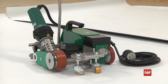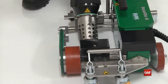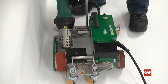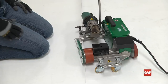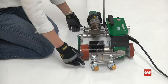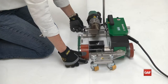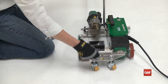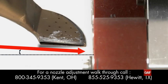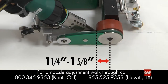It should take about 3 to 5 minutes for your Roof on Edge to rise to full temperature. The design of the Roof on Edge is unique in that the pressure wheel sits about 8 inches away from the body of the machine, allowing the nozzle to slide to the outside of the body. This unique design allows you to weld within 1 inch of your skylights or parapet walls. When ready to weld, line up the rubber pressure wheel on the front right of the machine flush to the edge of the overlapping layer, and the guide wheel at the back of the machine to run against the outside edge of the overlap layer. This will allow the machine to move in a straight line along the seam. Then disengage the caster wheels by pulling the handle in towards the machine. The welding nozzle should be slightly angled down into the seam. The edge of the nozzle should stick out about 1/16th inch from the edge of the material. The distance of the nozzle from the pressure wheel should measure about 1-1/4 to 1-5/8 inches from the center of the pressure wheel.